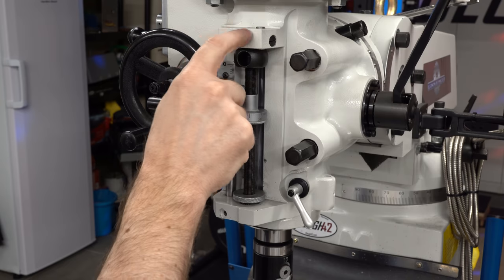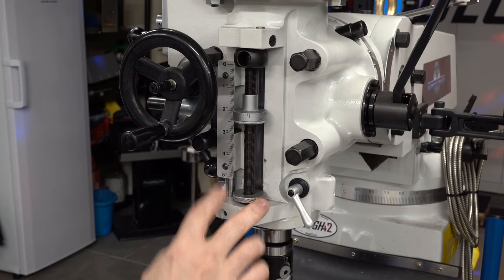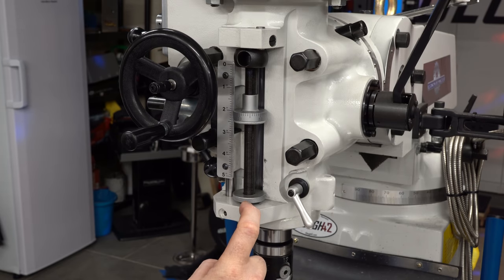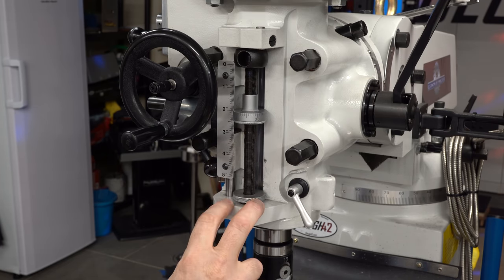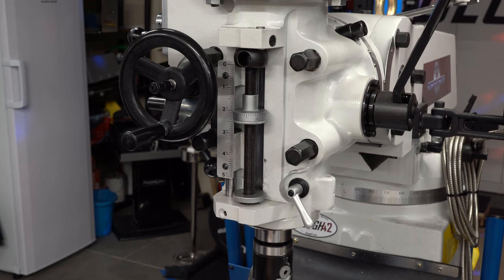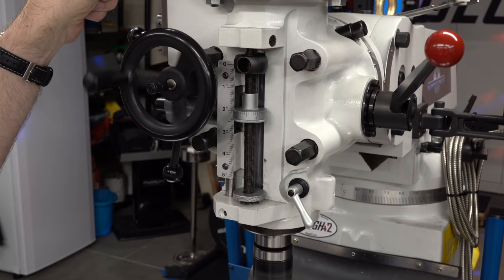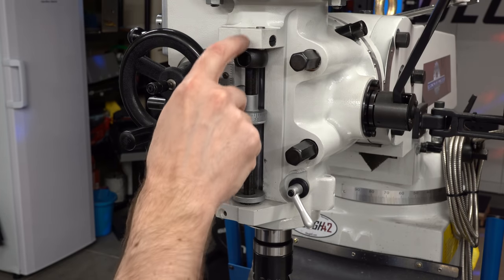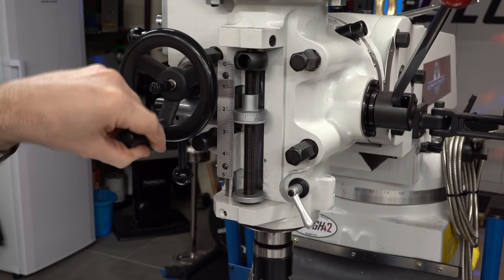This takes a lot of force and there's a tremendous amount of force on that tiny little barbell — it is very common for those to break. So you probably don't really want to trust this. It's not an adjustable stop in the upward position, and you probably don't really even want to trust it in the downward position either, because the manufacturer does not make guarantees about accuracy. On this particular mill, Precision Matthews claims only within a hundred thousandths — a tenth of an inch — which is a pretty wide margin. So you really want to feed manually against the position if you have a fixed depth you want to hit. Test it manually in neutral first to make sure it really does function.